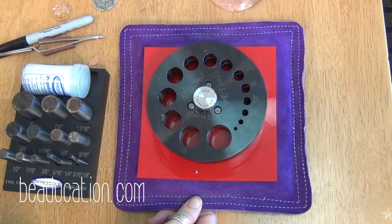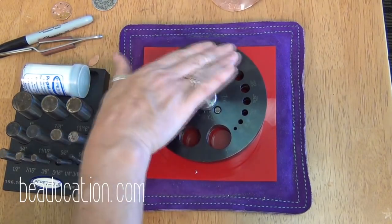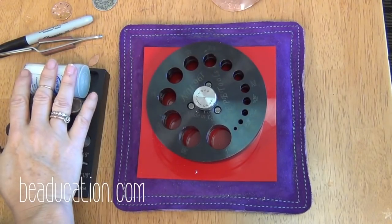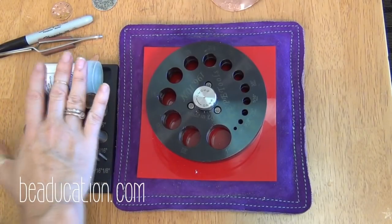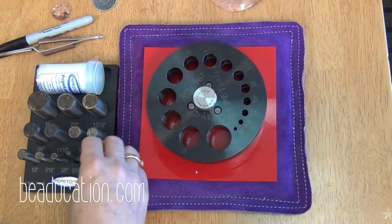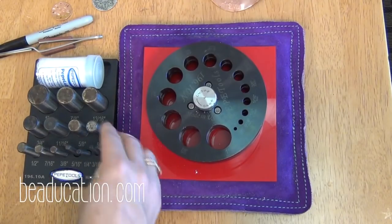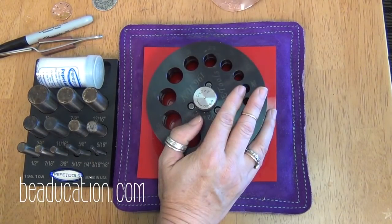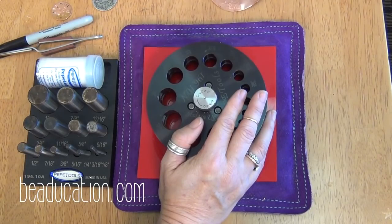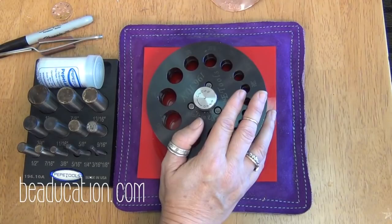I have a question about the cutter. Will it rust? It's tool steel like anything else, so don't get it wet, and to preserve these, keep everything coated in a light layer of oil. In fact, it comes with a big sheet of instructions, and it says to store it by laying an oil-soaked cloth over the top of it. Mine has never rusted, and it's out in the elements, but I don't live by the coast or anything. It's not a bad idea just to keep everything layered in a little bit of oil, just like you would your stamps or any other tool and steel. I know that Taryn's has some rust and it still works very well. Yeah, and we have an episode you can look back in our archives on the Facebook page under videos where we talk about how to remove the rust.